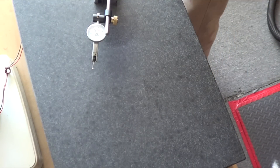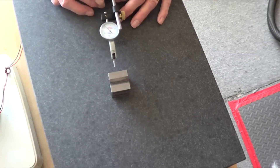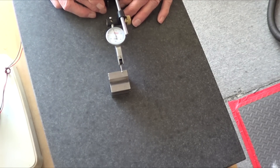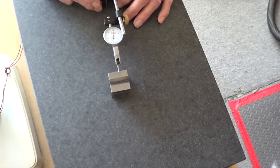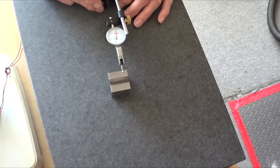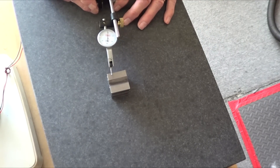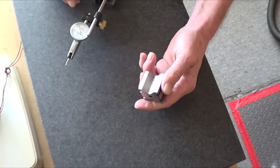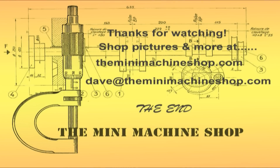There's supposed to be a matched pair — they've got the same serial number on them. See what that does — it should be the same height too, and now it's off. This one's flat — nice. Take it up a little, zero. We're pretty close — half thou under. Alright, so this block is good. So I have a good block and I have a junk block. I need to label that. Alright, well I just wanted to share that.